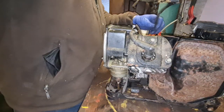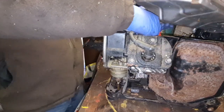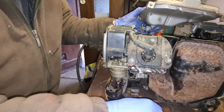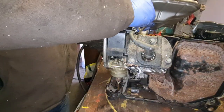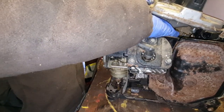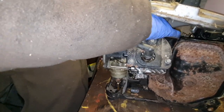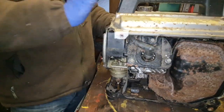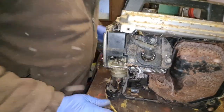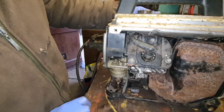And this one is just an overflow. Where does that fuel tank come? That must come this side. So if we put our fuel pipe on, little wire clip thing, put the little wire clip on. Do it right. There we go. Get our fuel pipe well and truly home. There we go. That's pretty much how that needs to be. Then we can put the end covers on.